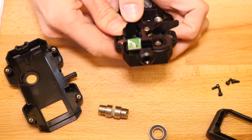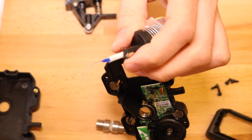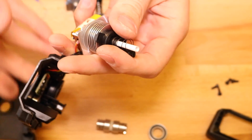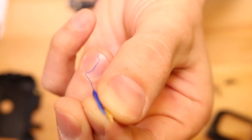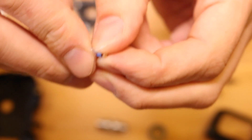Now when you open this piece up, you'll see a piece of filament sticking up and you can just grab this and pull it out. And that's it — now the extruder is unjammed. Here are the pieces of plastic that had jammed it. Now they've been removed from the Smart Extruder and we can discard those.